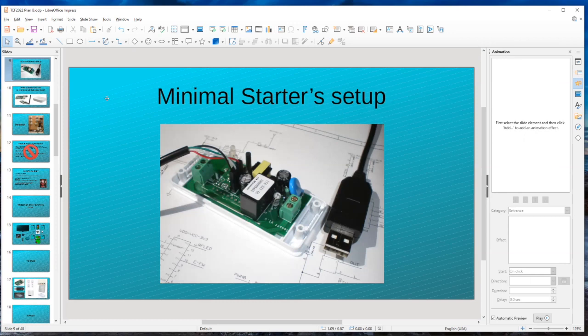That is exactly how I started when I was doing this stuff with X10. I had a TCP daemon that would interface to a CM11, which was an RS-232 device to X10, and I would send X10 commands. Later on, I got the Insteon interface, and then with SmartThings, I was a little underwhelmed because they gave you boxes. Everything was in boxes.